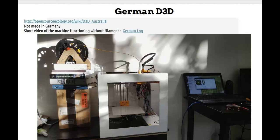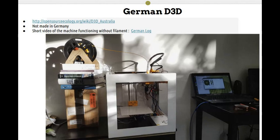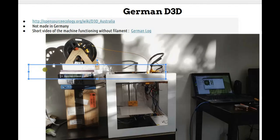And it was probing. So the reason why I put the axis with the motor on the Y2 side is because that gave me an extra inch of movement on the X axis. So I currently have the 8 inches. If I put the motor on the left-hand side towards Y1, I get restricted on the movement.